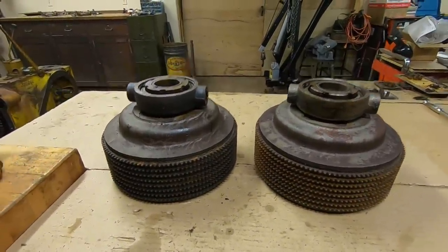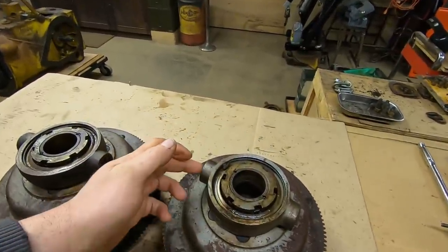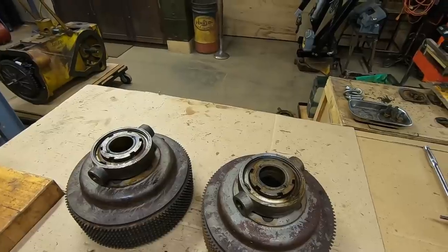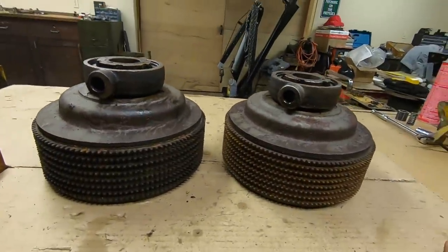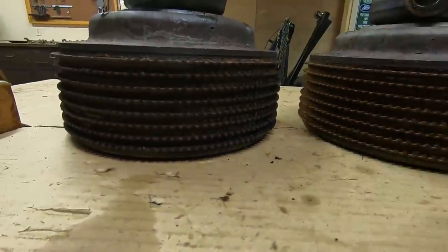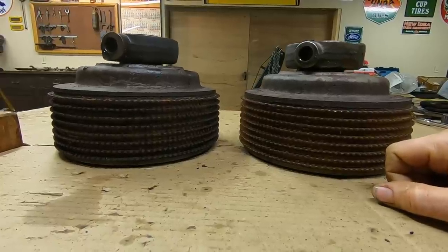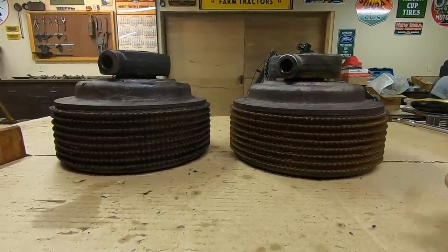Over on what's going to be our teardown bench, we have both of the steering clutch packs. We need to assess these somewhat before we take them apart. The release bearings are honestly a lot better than what you usually find — I do have brand new ones going in but I don't think I'm getting rid of the originals yet. We also want to measure clutch pack thickness on both, since we have thickness specs: new spec, minimum spec, all that.